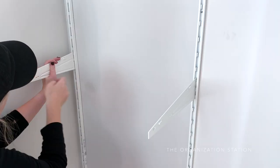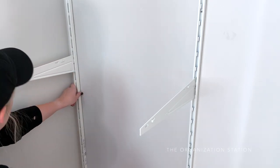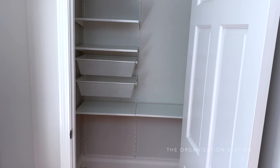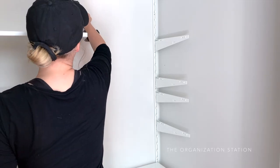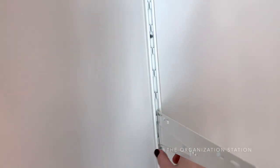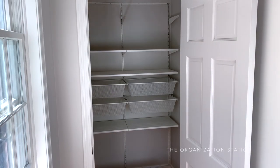All three vertical upright pieces were hung off of the horizontal suspension rails, leaving approximately half an inch from the baseboard at the bottom. Next, all of the shelves and drawers were placed exactly where they needed to go — do this before you screw the vertical upright pieces into the wall. If you do the opposite, you could run into a problem where they aren't level and the shelves won't line up correctly. Once the shelving is in place, shift the vertical upright pieces so that everything is centered, then drill pilot holes. I only added two per vertical piece, which was sufficient. Anchors were added and then the vertical upright pieces were screwed in place, and all shelves and drawers were reattached.